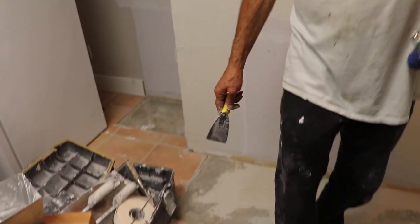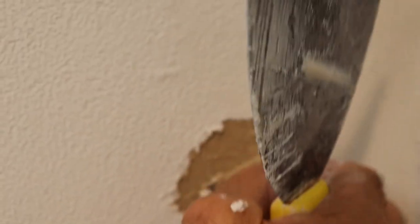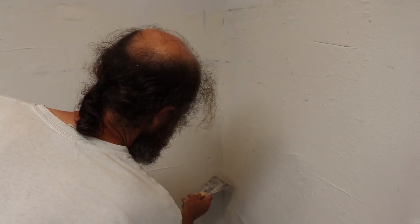We did the cleanup — looking good, like you can see. Just a little bit to have a better work place. I'm gonna show you guys what's happening here. In this situation when we remove the tile, some loose paper — see how it is moving. It's not near underneath; the paper is just loose from the drywall. Don't worry — just dig it out, just remove this part that is loose paper. The concrete is still soft, so we just come with a little bit and load it up. If we see more spots like that, we just keep moving — like you guys can see, here's another one.